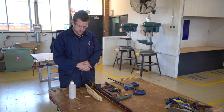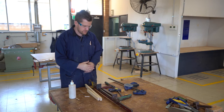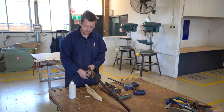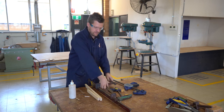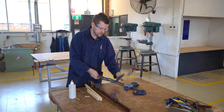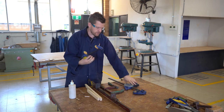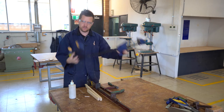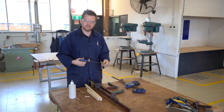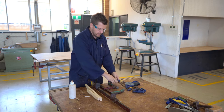Now that we've got our holes drilled for our dowel joints, it's time to glue and clamp. There are a few different clamping options: we've got a bar or sash clamp, an F clamp — F because it looks like an F — and quick grips. They don't provide heaps of strength, but they're really good for just quickly holding stuff together.